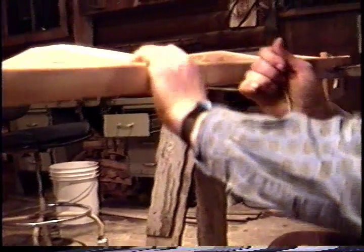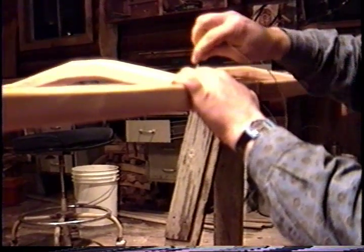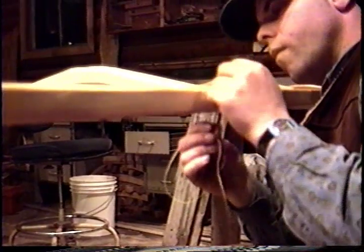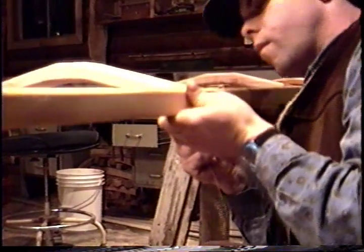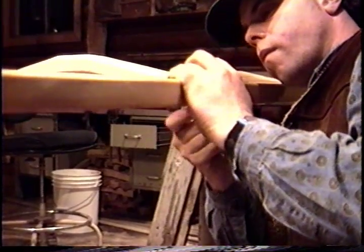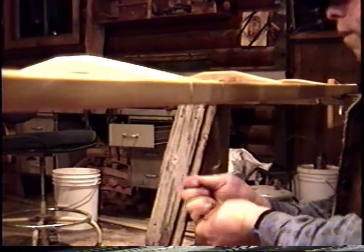Then you pull it back down through nice and tight, and you tension it up as much as you can, lay it exactly in that scorp line on the gunwale, and you go back up over the top, pull it down through so that these lashings lie just exactly where you want them to be with plenty of tension on them to hold the ribs into these gunwales that you can see Corey's hand is actually over them.